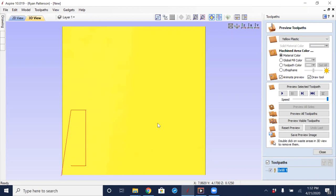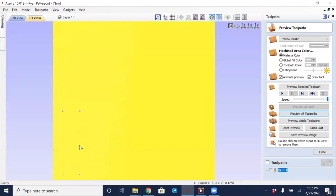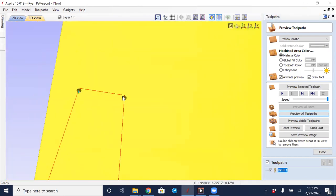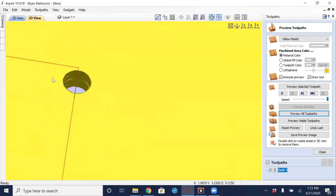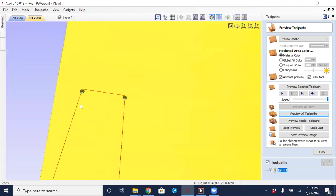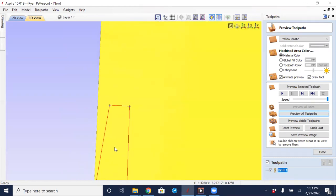Now in the 3D view I click the preview button — boom, boom, boom, there are the three holes. That looks good. The toolpath preview may not perfectly show the stepping motion of peck drilling, but you can see the small dots indicating the steps. We can see it is stepping down by the 10 thousandth peck drilling increments.